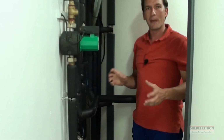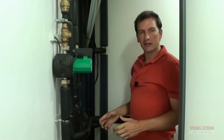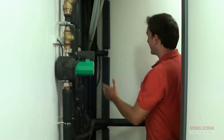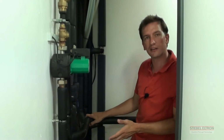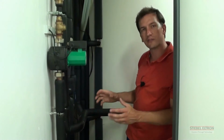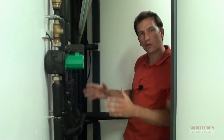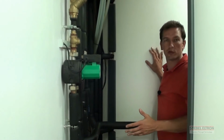This little bit of a marriage where you marry the two systems is the secret of this whole system. It's so simple, but the secret is lying in vertical tanks. You will never ever find a system, whether you go outside South Africa, to Europe or the eastern countries, any alternative energy system consists of vertical tanks, whether it's a heat pump, a solar system, or a marriage of the two systems. It's always a vertical tank.